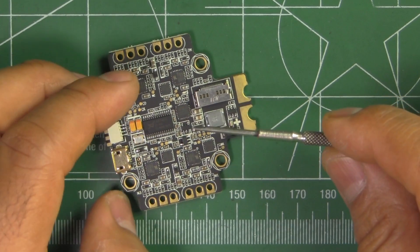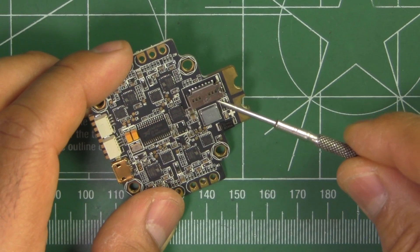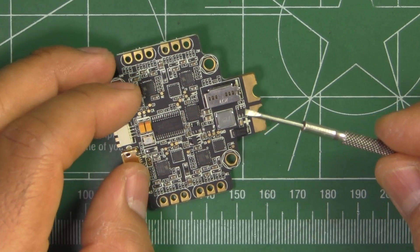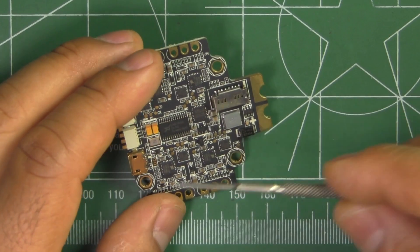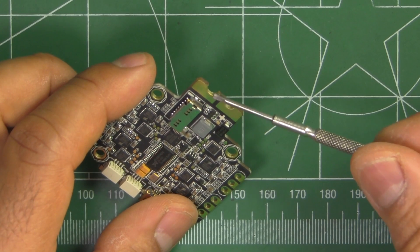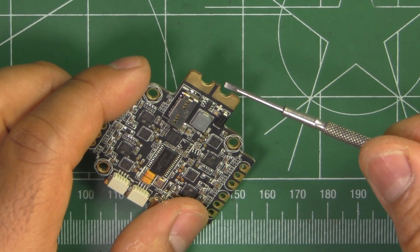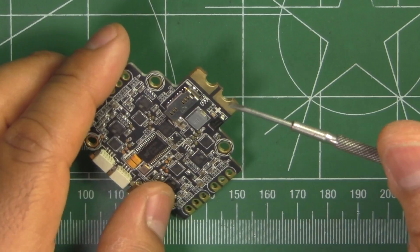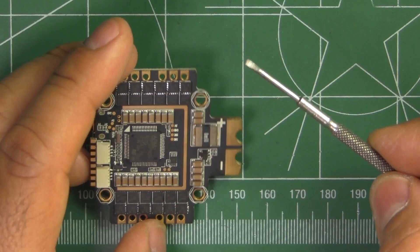Although for the camera and VTX, you probably want to use a separate BEC. The good ones to use are those DSUN BECs, and just use a cap at that BEC output — possibly even a 1000 microfarad, 25-volt, low ESR capacitor right at the board. Panasonic FM and FR series capacitors are pretty good; that's what I use and what most people use.